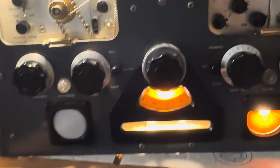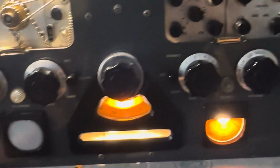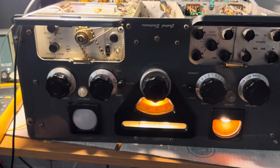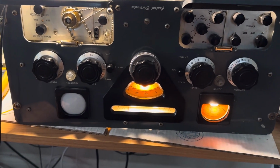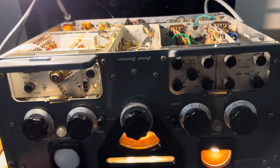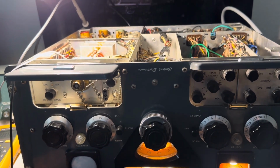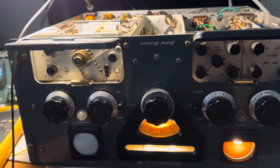What can I say? Fixing these boat anchors is laborious. It's time consuming. It's kind of fun, but when you don't make much progress, you kind of wonder what you're doing. And that's kind of where I'm at with this one. This is probably the hardest radio I've ever tried to fix. It's the most complex. It's been the most fun in many ways, and it's the most rewarding, but I've probably burned 3 weeks of time on this thing now, on and off, fixing the power supply, and I still can't get the power supply working. I converted this thing to a 200V power supply as best I could, but the power supply voltage, as you can see, is too high. All right, that's my demo.